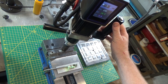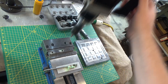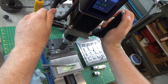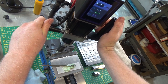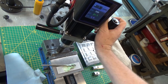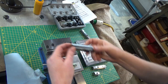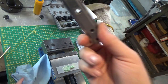I have it on 150 RPM but it seems like I could go faster. These are 3/8-16 threads and they're looking kind of beautiful. Since we don't seem to need the torque protection, we're going faster. Much faster coming out too — again, like butter. No challenge whatsoever, didn't bog down. Some beautiful threads right there.